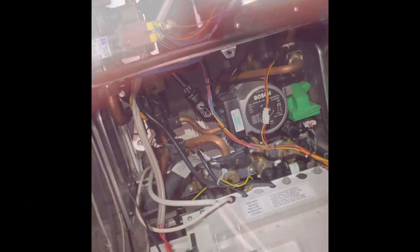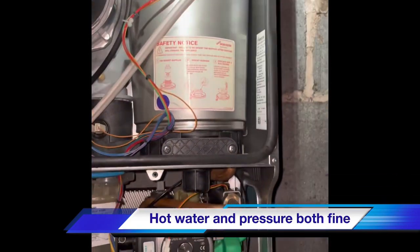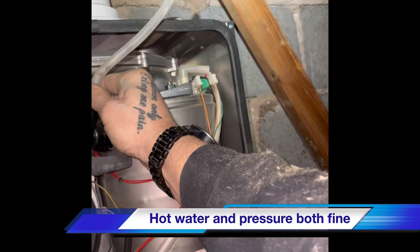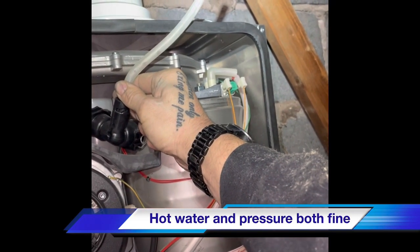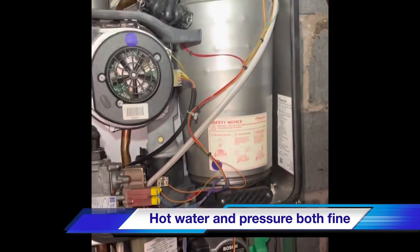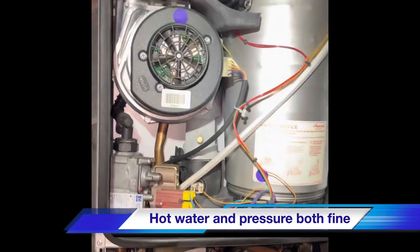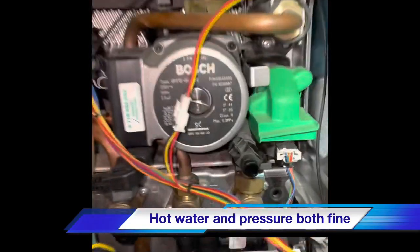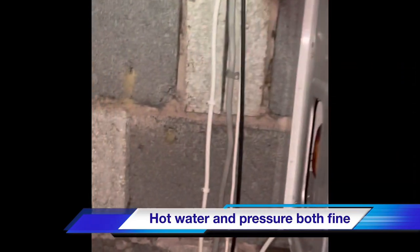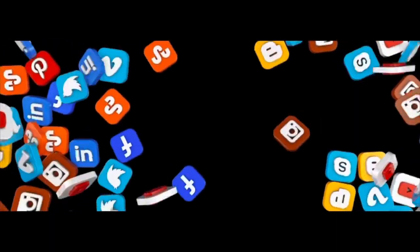You can get the plate in and out in 10 minutes. The new plate heat exchanger is back in, cold ports reconnected, cold's back on. We're now bleeding the heat exchanger — it's important to do this at the highest point. Originally I've had some issues with this boiler and these nipples have been there for five years. The system's full and we're ready to put the heating on — let's see what happens.